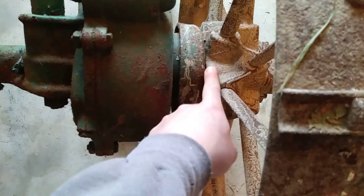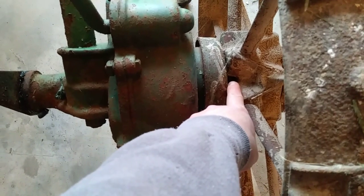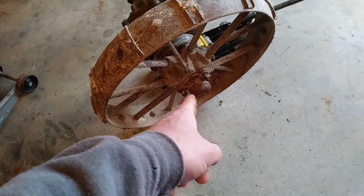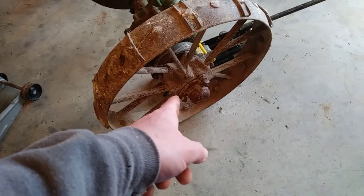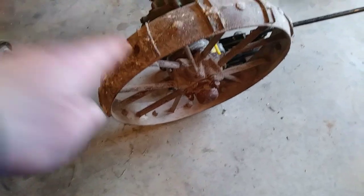Right in through here - see how that's solid, and then you get to this one, it's got a notch out of it where a grease fitting is supposed to go down into there. It's not just a short little grease zerk - it's a grease zerk with a long tube out the bottom. Maybe that tube is broke off. I've looked with a flashlight and can't hardly see. I think I'm going to go ahead and take this wheel off. There's a YouTube person - Tyler the Plow Guy - who makes a really good video on how to take a wheel off.